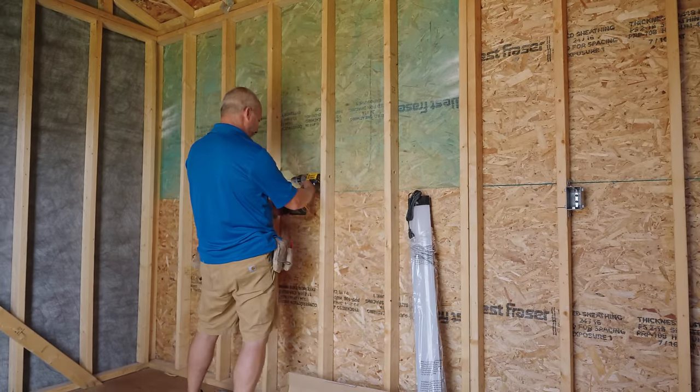Now for extra caution, we could show this too. For extra precaution, in a box, you can take electrical tape over your contact points, bring it underneath your screws, over your contact points, underneath the screws. And that is a great ounce of prevention. So even if you're playing with it, and you touch the actual live screw, you aren't gonna zap yourself. Now it's not foolproof, so don't bet your life on it,